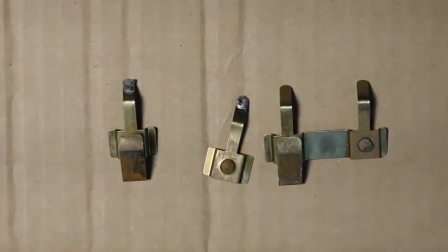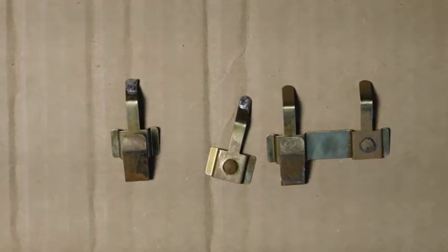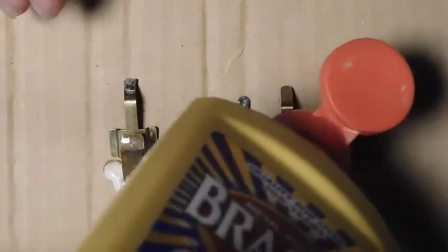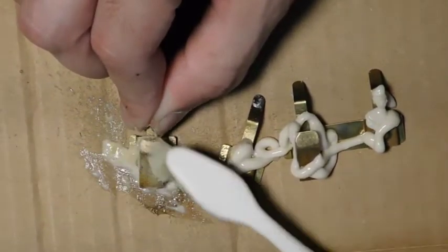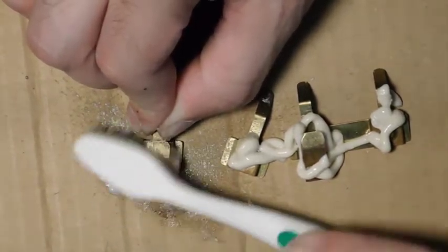I've got the battery terminals on a little piece of cardboard because I'm going to be scrubbing them with some Brasso. I want to say that I absolutely do not recommend Brasso on things like game cartridges — it's very abrasive, it doesn't clean off easily, and you can permanently damage your games. However, Brasso does have its purposes as a metal polish, and that's exactly what I need it for here. I need to polish this metal to get rid of any potential impurities before I start the electroplating process, because those impurities are going to interfere with the chemical reaction and I won't get a good nickel plating. So I'm going to take the Brasso with a toothbrush and give it a good scrub to get rid of whatever gunk was left over from the battery corrosion.